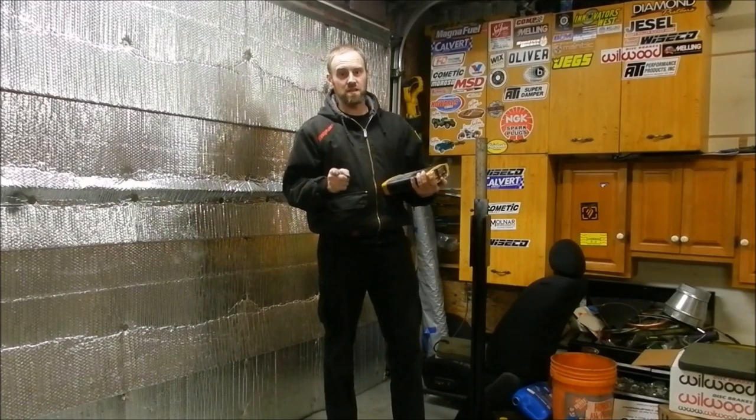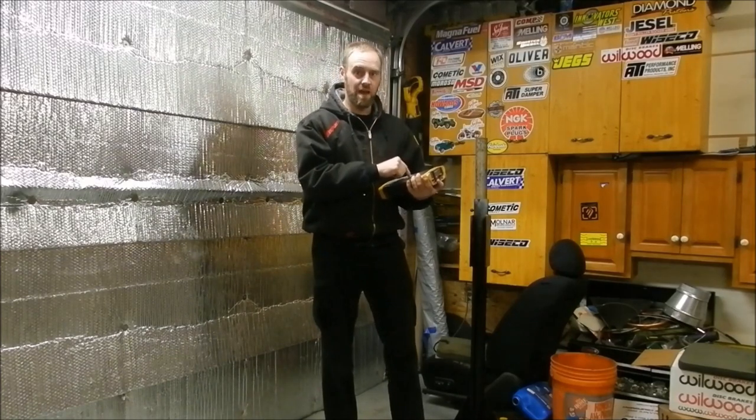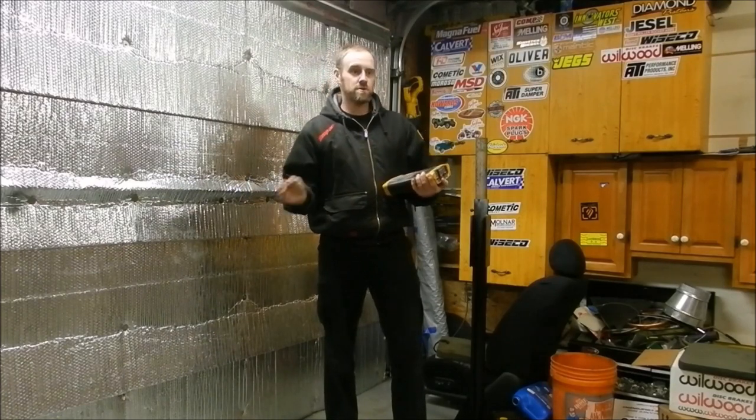Scanners are nice because they give you a location to look towards. So say it says fuel pressure is erratic or something weird like that — that is when you break this guy out. You find out why the fuel pressure is erratic, whether it be using an amp clamp on the fuel pump or whatever.